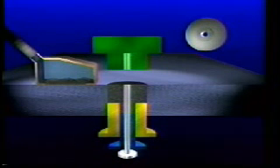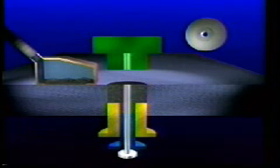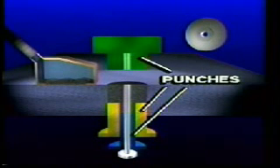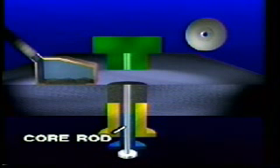Tool sets are made of either hardened steel and/or carbides. There is a die body or mold, and for simple geometries, at least one upper and lower punch. And in some cases, one or more core rods, which will produce the designed-in holes if required.